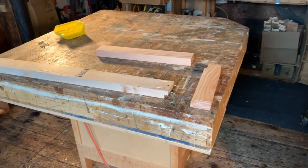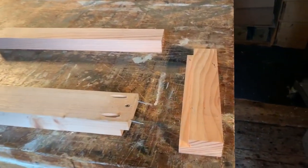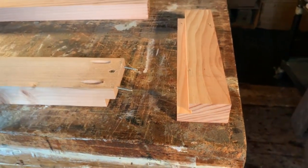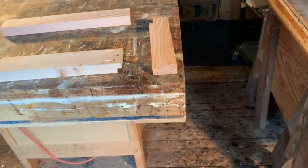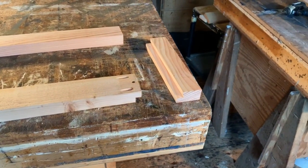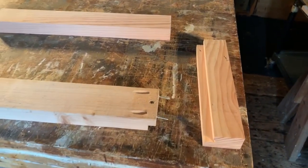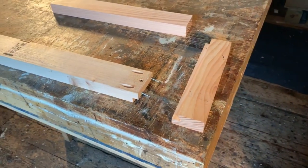Just want to take a moment to show one of my favorite joinery methods. This is what I would call the half lap pocket hole combo joint. And it's really quick to make and an incredibly strong joint, and is good for making structural framework with 2x4